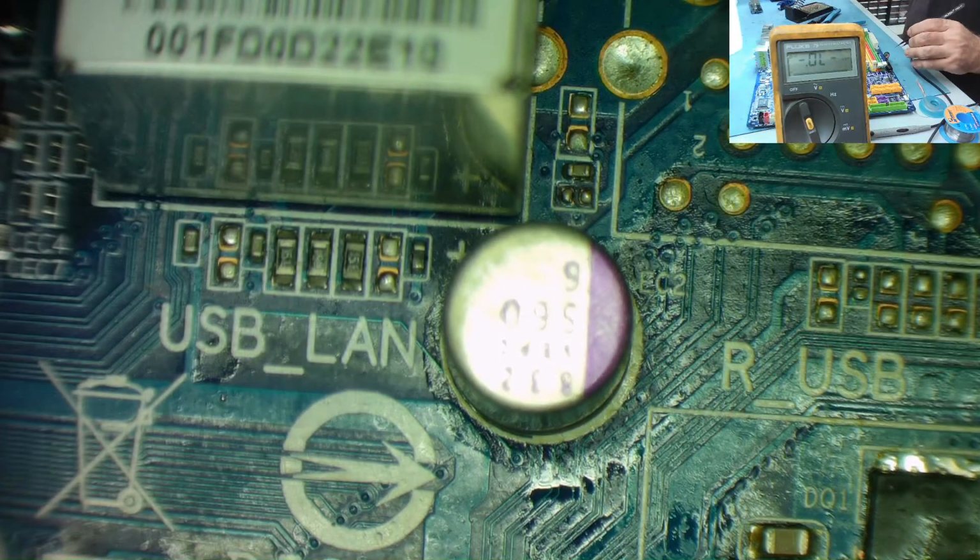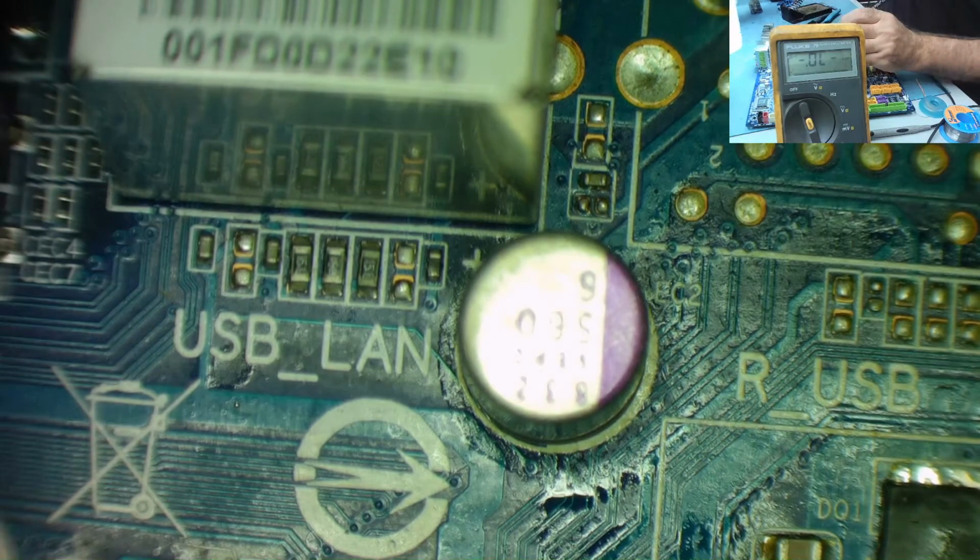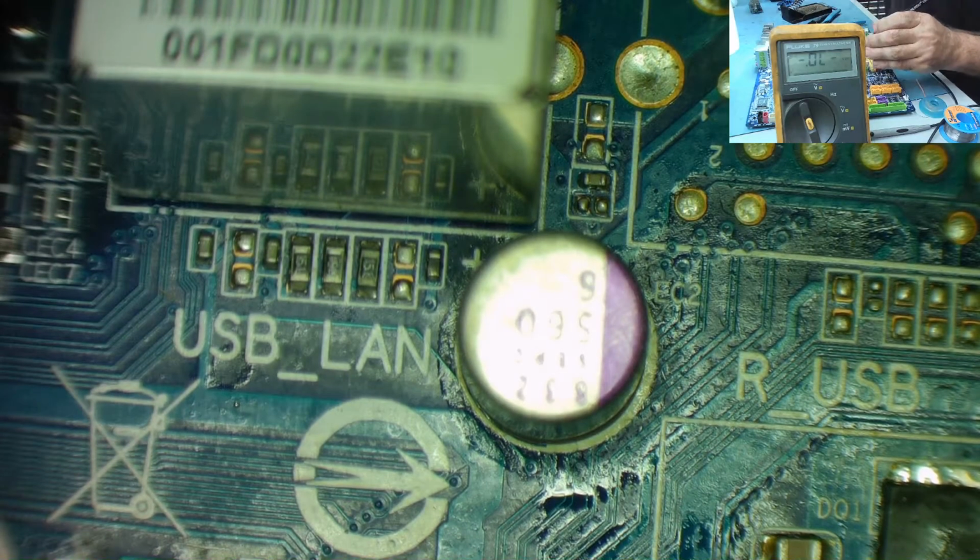Okay, that's got it. So you see, the pins are almost lined up. I just moved a little touch. I mean, it's fine as it is. It's not. It's because there's little bits of solder on. That's all it is. Okay, that's in place. If I now heat this up with hot air and just press it down with the tweezers, this will solder. Let's just do it.